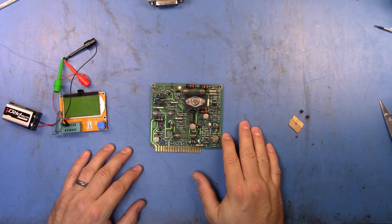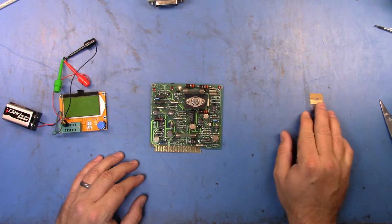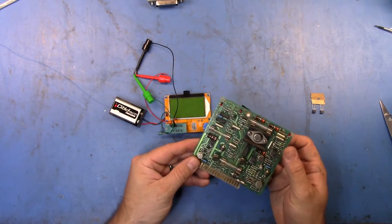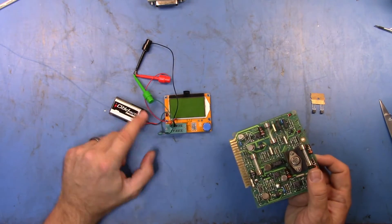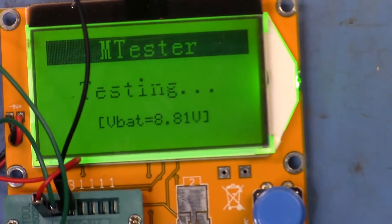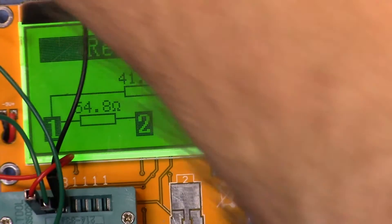Good afternoon. I went up and managed to grab what I think will be a little transistor that can replace this one here. If you remember, this was the Q6 out of the current limiting part of the circuit, and when we tested it, Q6 came out as just a short. So let's try one of these - they've probably been sitting in the NTE dealer's stock room for quite some time. Let's put this guy on and see what he comes up with.